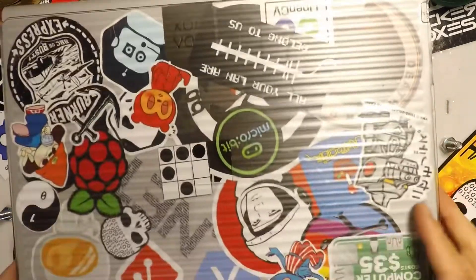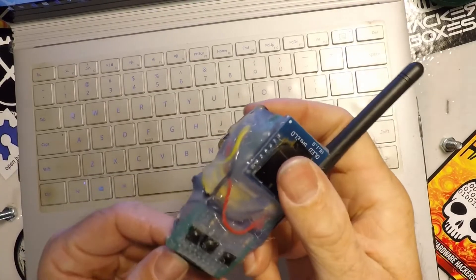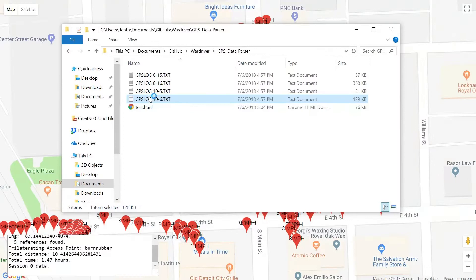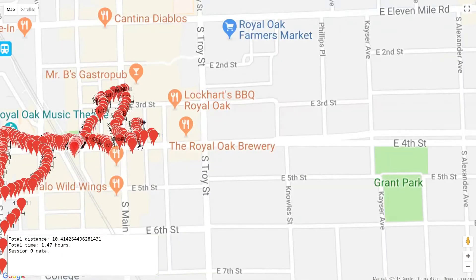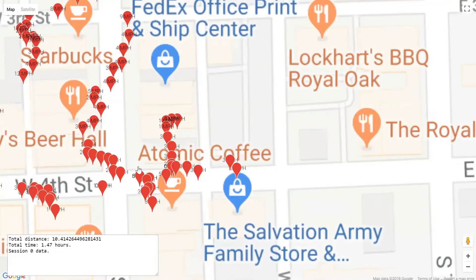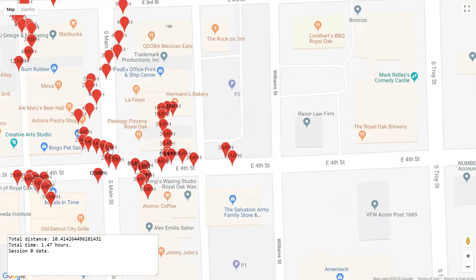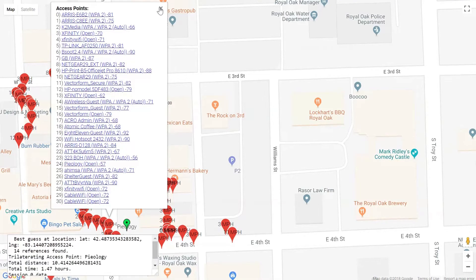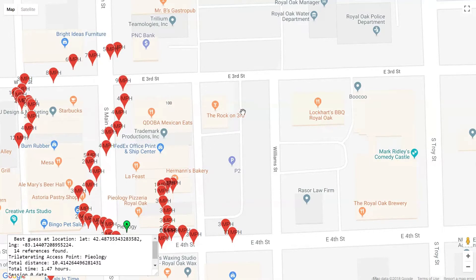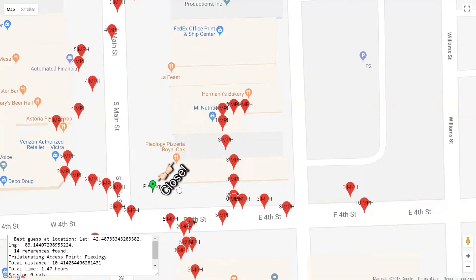Alright, now that we have a whole bunch of data, let's see what kind of information we can pull from it using this app I wrote. Let's pop the SD card out and put it in a computer. From there we can open a log file, copy all the data, and put it into the app. I decided to just make a web page that you could run locally — it's nice because you can just leave it on the memory card and open it on whatever computer you're using. It's kind of amazing the amount of information you can pull out of a set of coordinates. I'm pulling the bearing — which is the direction you're pointing — how far you traveled between two points, how fast you were moving, and a couple other things. Figuring out the calculations for all of this was really interesting.